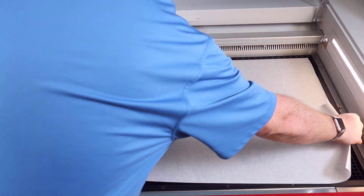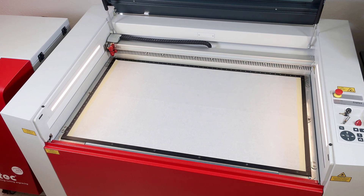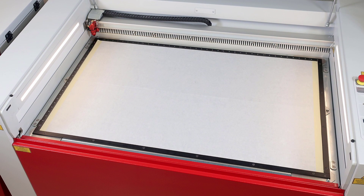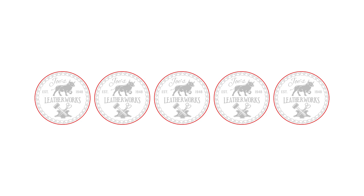To start, use some application or transfer tape and cover the aluminum cutting grid table on your laser system so that the table is completely covered. Design your file and send the file to the laser with a red outline the size of the part. This process can be set up for a few parts or can be arrayed to fill an entire engraving field.